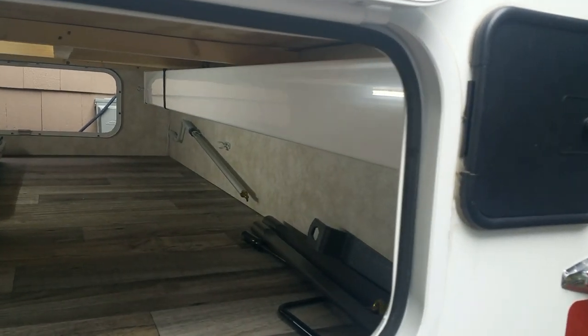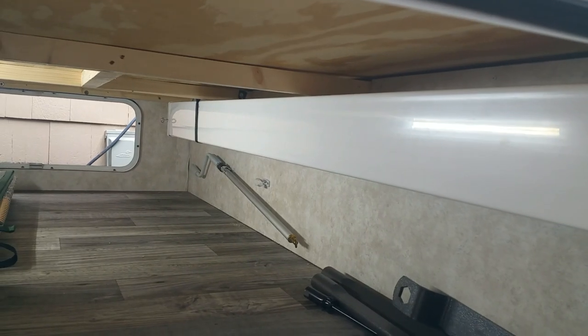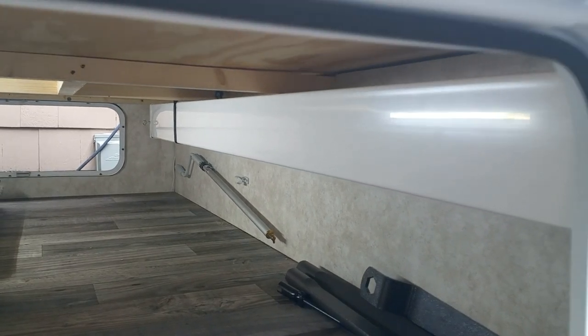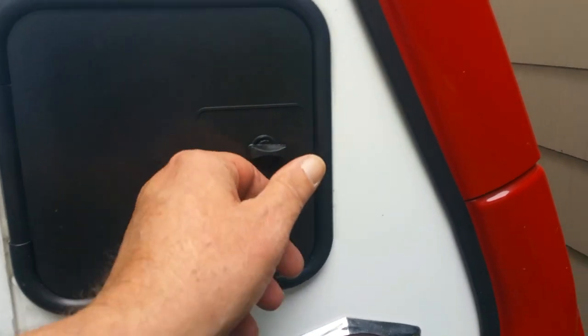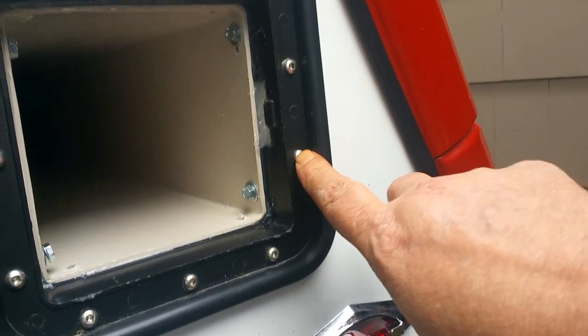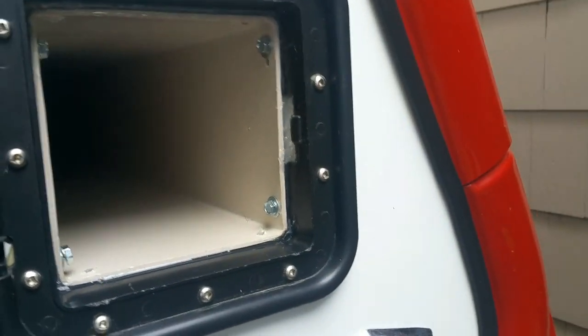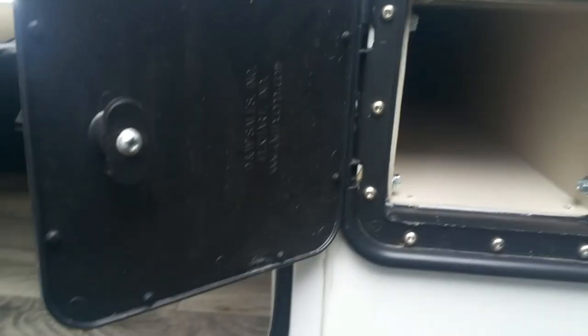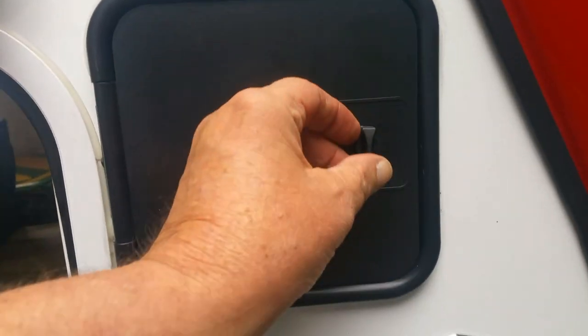The installation is complete. Here's how it looks on the inside. I put that strap on the back brace as I said before. I didn't feel like I needed two of them. Moving around to the door, it's all screwed in with the self-tapping screws. I drilled a pilot hole larger than the screw so it only screwed into the frame. I put silicone on it. Over here you've got to put some silicone behind because of the latch mechanism, and you've got to make sure you set that fence post back so that the latch over here can hook up. So there it is.